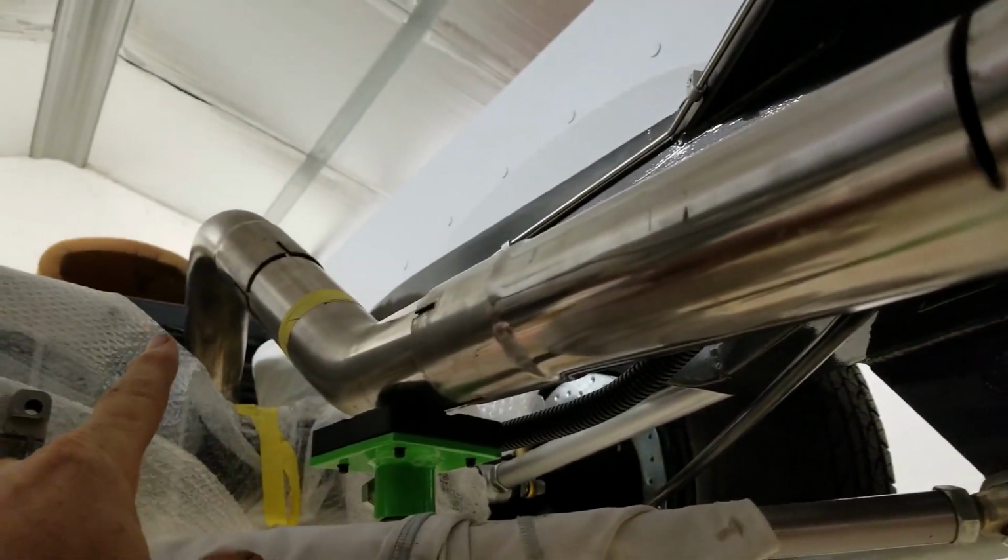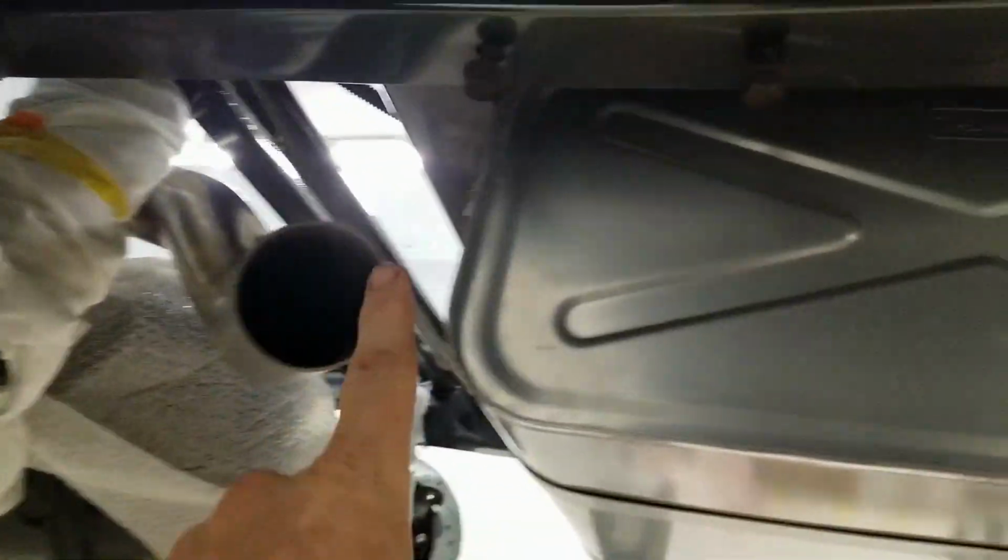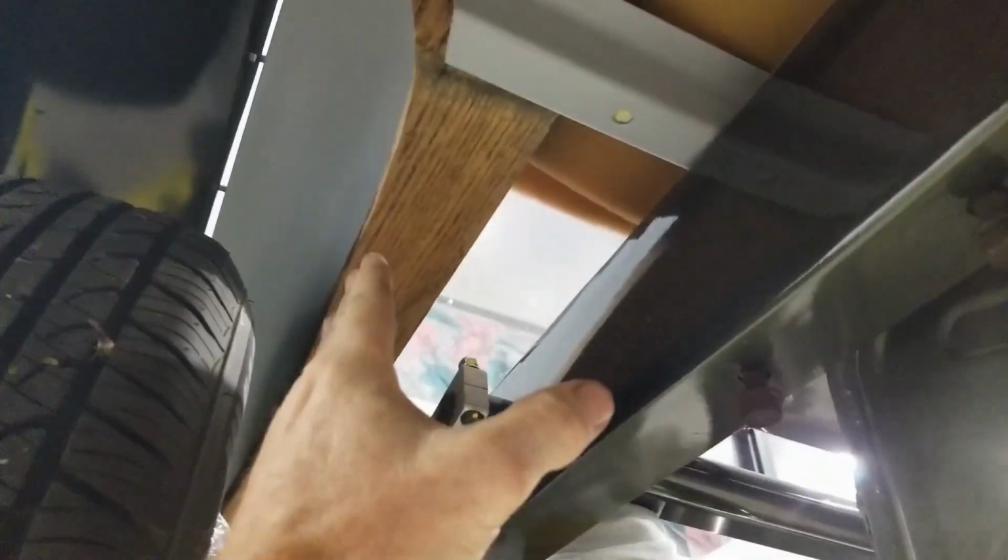Of course, we are covered, so we don't trade any paint, and we have jack stands underneath this just to hold the right height. So the pipe is going to come right out of the muffler, up over the axle, and then come down around here, and then we're going to curve pretty sharp here out the rear bumper area. And we got to make sure we clear, because we're going to have a big tire here.